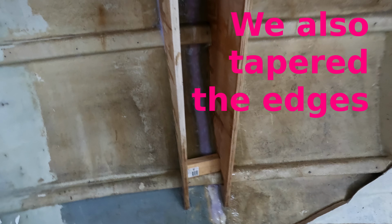That's where the groove was from the original bulkhead. What we did was grind and sand it out to get rid of all the plywood and the grey glue filler stuff that was used. Then we painted it with thin epoxy, filled it with thickened epoxy and laid glass fibre tape over the top of it. As you'll see, that then gets covered with more layers of glass fibre tape so that we are doing a strong bridge across the gap between the two bits of tabbing. Back to the footage.